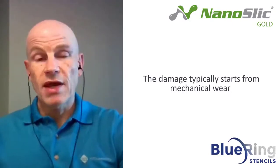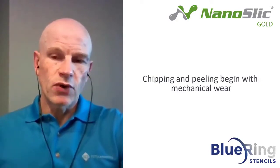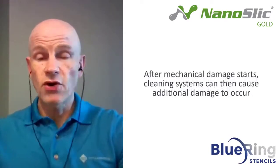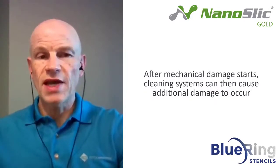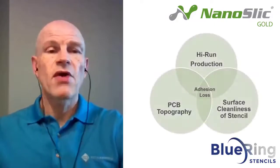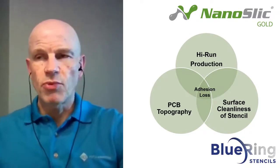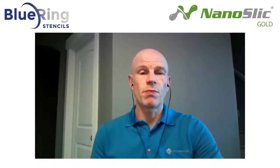Now, there are cases where that mechanical damage can start, where there's some chipping going on in the coating. And then you put a coated stencil into a cleaning system, especially a cleaning system that would be a high pressure spray and air type system. And the spray pressure itself will impinge on the edges of wherever the coating's begun to crack, and it'll continue to break it away slowly over time, chip it away. And so you can pull a stencil out of the cleaning system, especially if it's a high pressure spray and air system, and it may look like the cleaner stripped the coating off, but really the coating started chipping due to some mechanical damage that occurred previously.